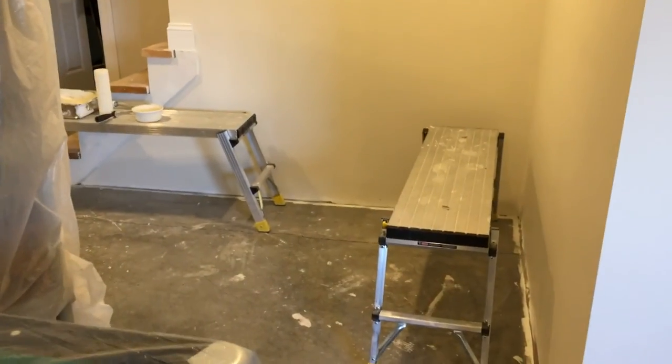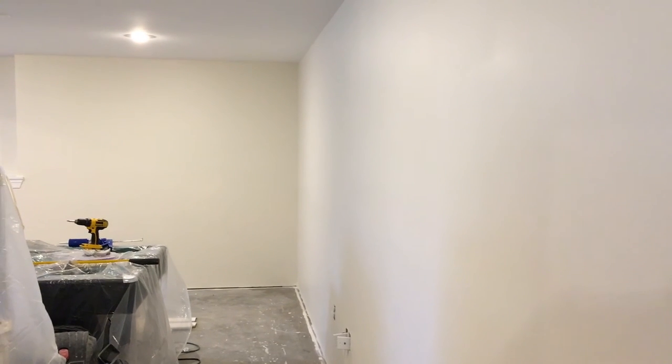I'm going to focus on the floor now, putting down an underlayment. That'll be another video. I'm using a DMX one step, and then I'm going to go ahead and put a maple laminate floor down over that. All I have to do is some trim work and then work on the staircase. Probably going to put carpet down for that.